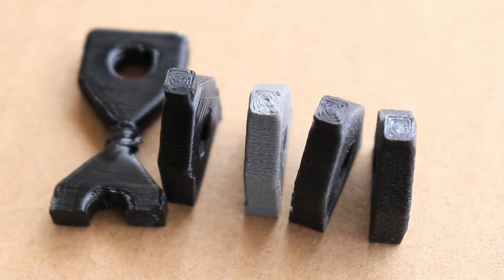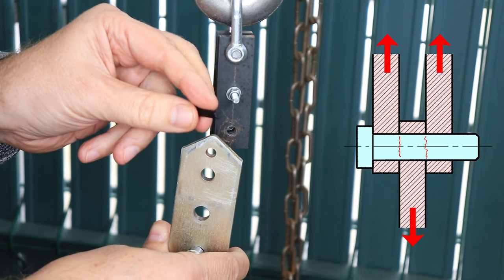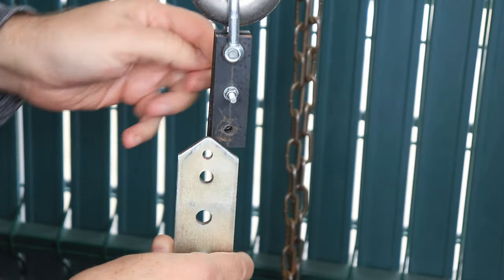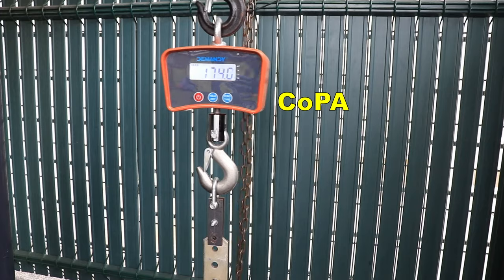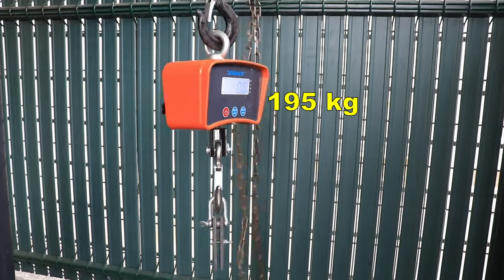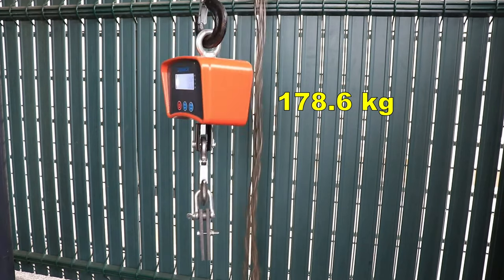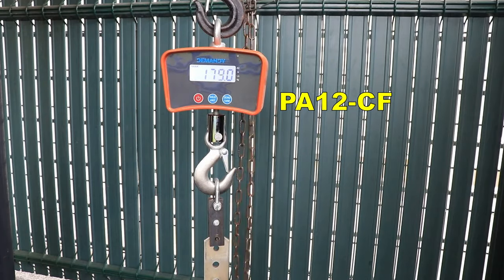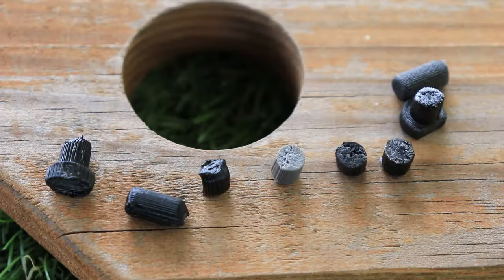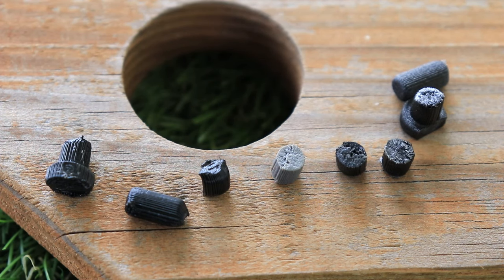Here are those four cross-section areas plus the over-melted version. Now the shear stress test. This test object is 5mm in diameter and the shear ring will be applied on two sides. Sometimes I couldn't find all three pieces but they all sheared correctly on those two cross-section areas, and for the feeling they are very strong in this type of test.